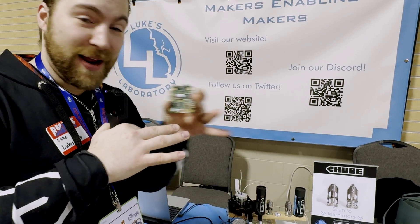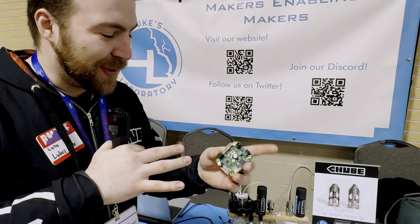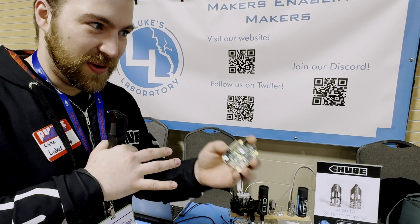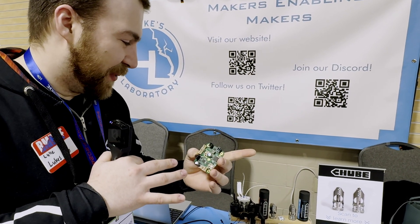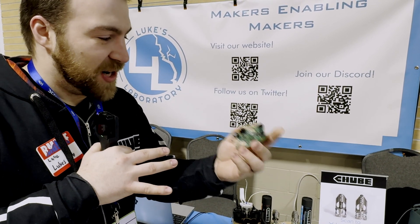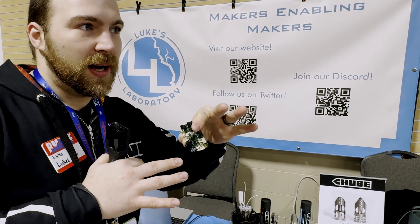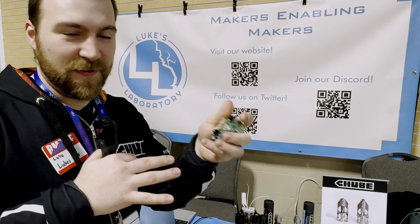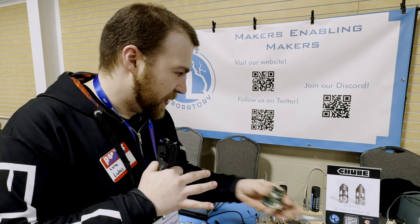This board is targeting a 100C rating so you can put it in whatever high-temperature chamber you like — we're hoping it'll survive to 125C before things go wrong, but conservatively 100C. We just built ten of them and will put them through their paces. Things are looking pretty good so far, and we're hoping to get them into an open beta as soon as we can. After that there'll be a smaller, lower-temp, more consumer-focused version with a nozzle cam port, RGB, and other features coming next.